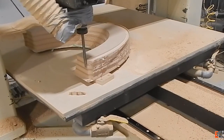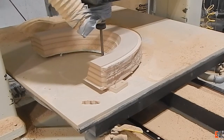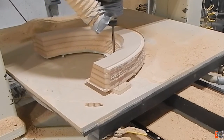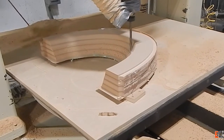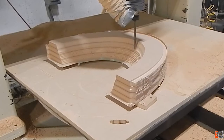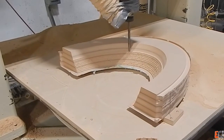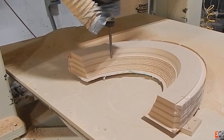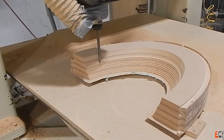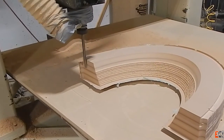This is the finishing operation with a half inch ball end carbide cutter — it's really long. I'm taking it slow here because it's an old machine and we didn't have a lot of RPM to play with, and we just wanted to go easy on things. It came out pretty nice, and having it blocked up off the table let us run the bit down all the way.